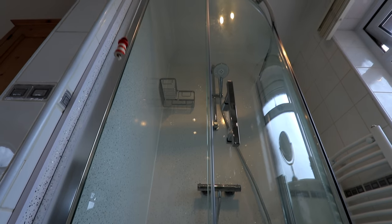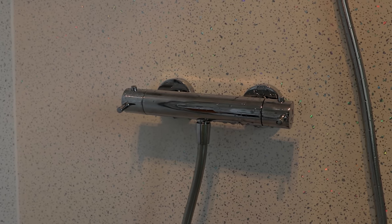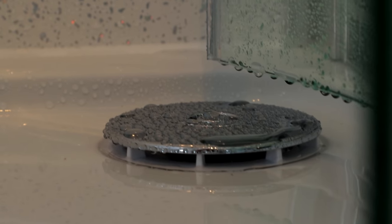It's not a straight away sort of job — get that done, wait for it to dry, come back another day. Take your time. Make sure you pressure test everything on the pipework before you put anything over it. For the siliconing, make sure everything is clean and dry with no dust at all — really hoover around and spend a lot of time on that. When it comes to a shower door, read the instructions — don't just look at the pictures because they can be misleading. I hope you've enjoyed this little series of videos. Mum and dad are happy. If you've got any questions, comment them below. Thanks very much for watching, and remember to hold tight — see you soon.